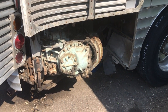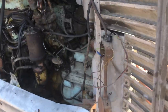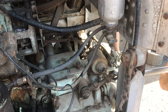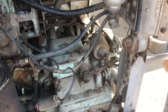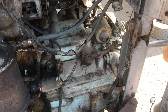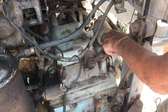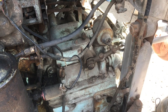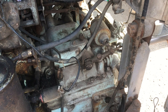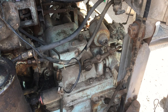See if that reverse lever works. It only moves out about 1/8 of an inch. Okay, but we have determined the solenoid piston is not jammed in. It feels free. So in second gear, that should pull out how far, do you think? Oh, probably an inch.